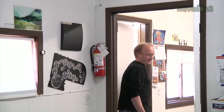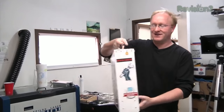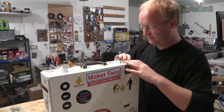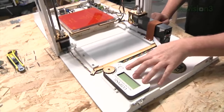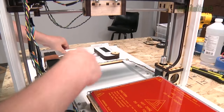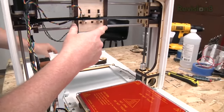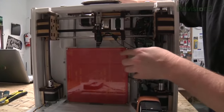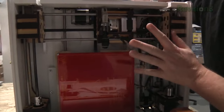I'm back from Maker Faire. I got the printer done just in time and got some sweet stickers for it when I was there. So I'm going to show you folks at home how it works. Let's open it up — we've got some latches here. You open up this side first, then this side. We have our control panel here, which allows us to control it without a computer. And the power supply — when you fold it up, see how it goes into that gap there. It's all about making sure that everything has its own place. This is the park position — it's up a certain ways and over a certain way, so when this folds together, it doesn't hit either the driver board or the print area. There's a special code which puts this into the right position.